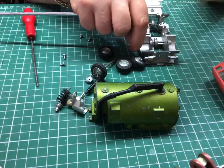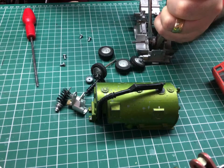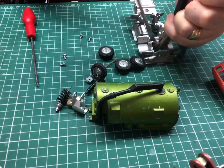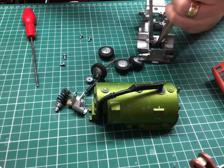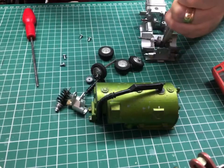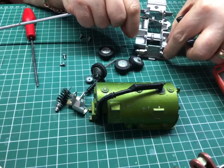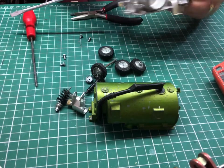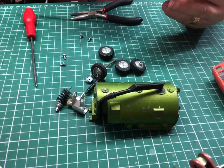The idea behind this was I thought, if you could pull it through and then lift it up, it'd pop out, but nope. I didn't really want to mess with these cogs, with the alignment, being the one on each pin. I didn't really want to mess about with everything when the spring goes back on, so the idea was to leave them alone. But you'll see in a while, when they put it in caustic to clean all the paint off the base, whatever was holding them in place, all the grime and what have you, the caustic chewed through it, so the little cogs fell off the axle, to be honest. So I had to realign them and line them up and put a bit of glue on. And they're all fine, they fell back into place pretty easy. So it wasn't a problem. I was panicking over it, to be honest.